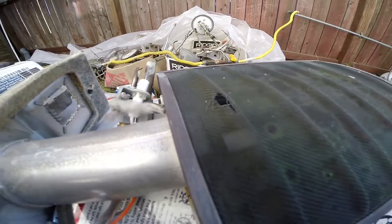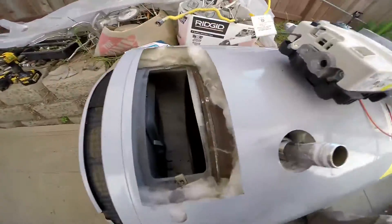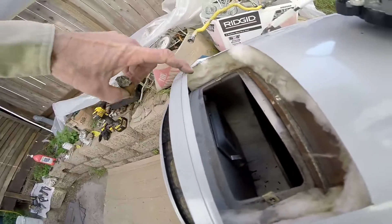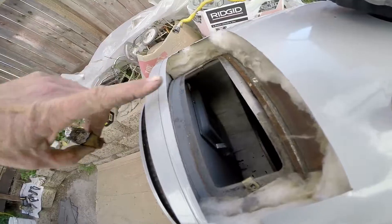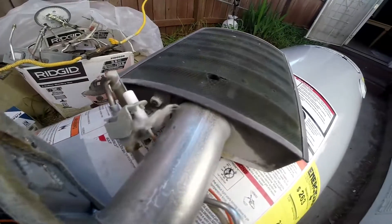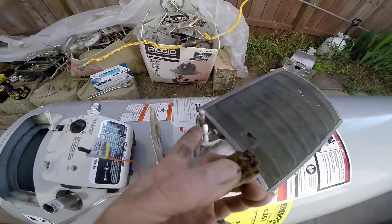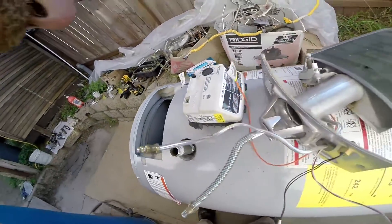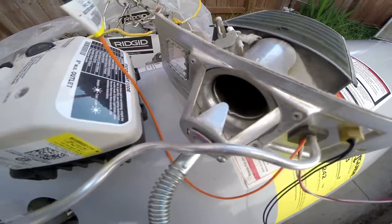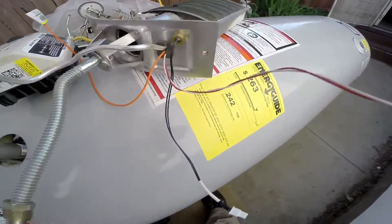This is the reason why — hopefully you can see it — there's a rip in the screen. It usually happens when someone takes the burner assembly out improperly and catches it on this little metal edge right here. Sometimes this metal isn't secure and it's a little bit taller, forcing you to drag that screen. What happens is the gas escapes through there, catches fire off the pilot light, and causes that backfiring pulsing effect.